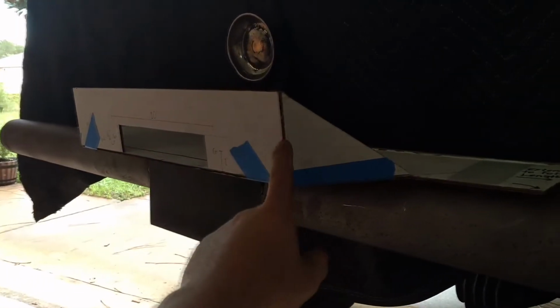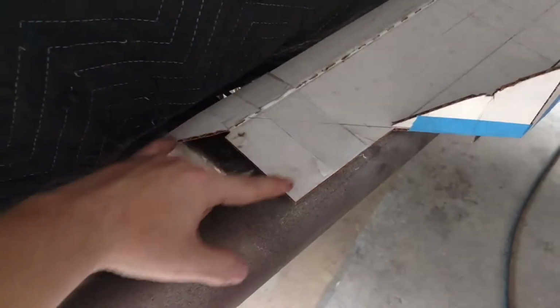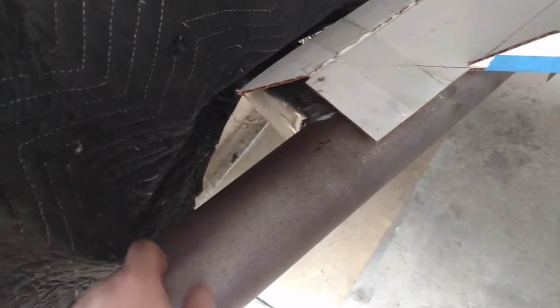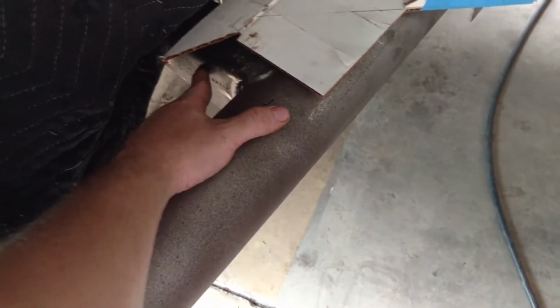But we're probably going to get these two pieces. One's the upper, one's the lower. Get those cut off camera, unless we can get some footage of it. And then we'll be laying it on here and extending this portion as long as possible based on the material we can acquire. Weld it across there, weld it to the frame plates, whatever you want to call those frame extensions. Because you got a lot of material in here and it's thick material. So weld it all the way across and we'll have a place to put a winch.